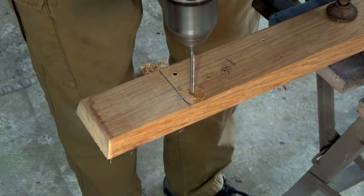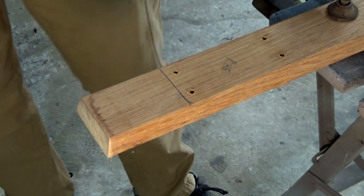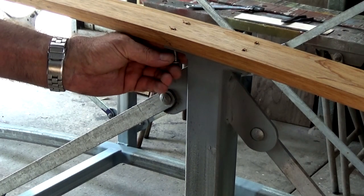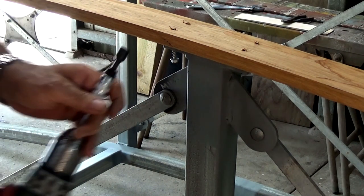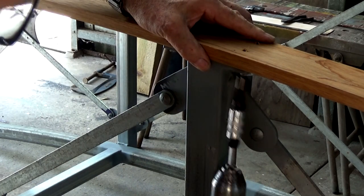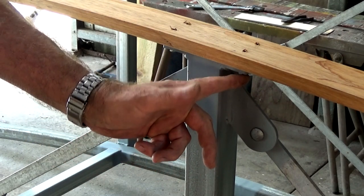I think the pre-drilled holes are going to be okay. I can drill right through here — the screws penetrate almost to the other side, and there will be another piece of wood on top, so we should be good. I've got this held down at either end with a clamp, and I'm starting at the second stanchion in from the right, just getting a couple of screws in progressively and tightening them up. That's always going to be the difficult one because of this acute angle — it's really hard to line up the driver on the axis of the screw.